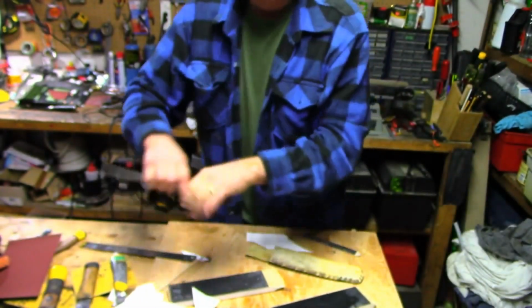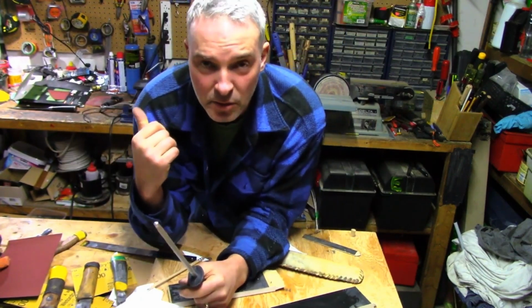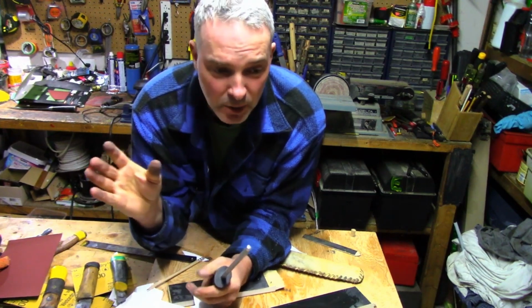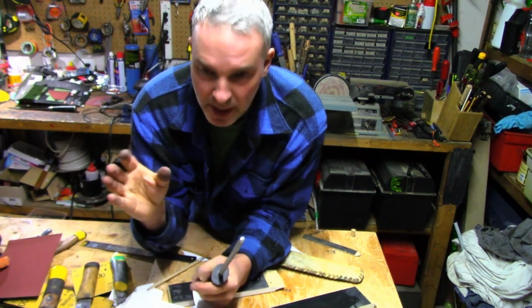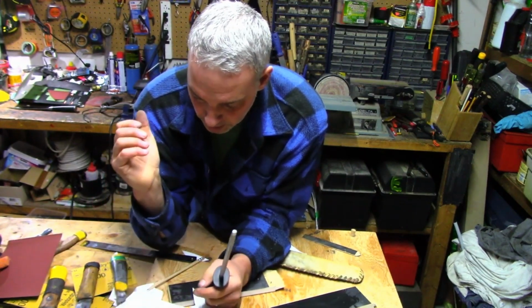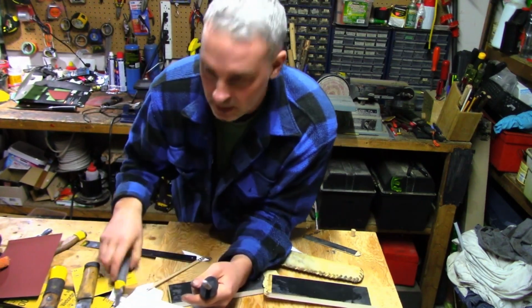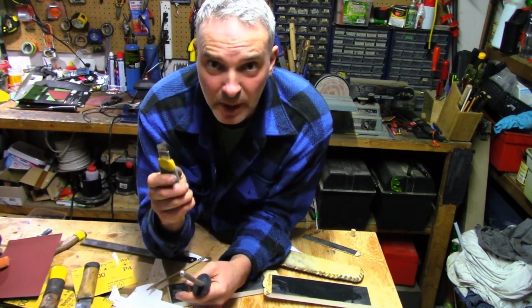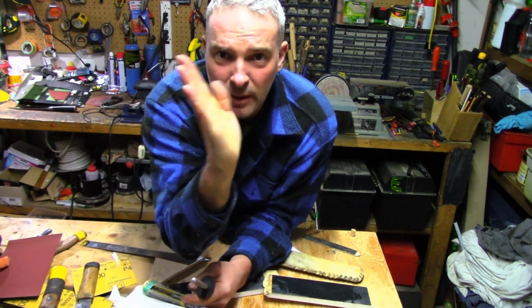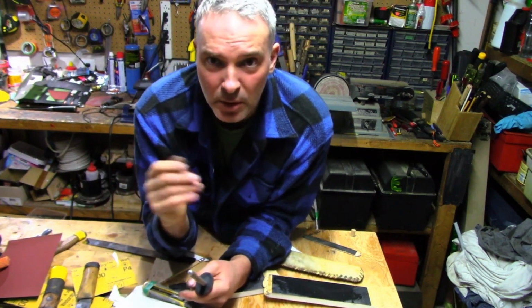So what you're doing when you're taking a hone to it and taking the strop to the edge, there are far more sophisticated explanations of this. I'm really massacring the explanation of this. There are better explanations out there, but it's not enough just to use the rough edge to make the knife feel and perform like it's sharp. If you don't remove that burr, which is almost like a little foil of material at the very end of the blade, it'll get curled over and your blade won't work right and will also damage more easily.